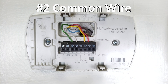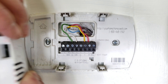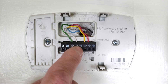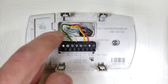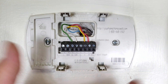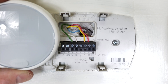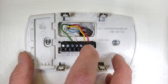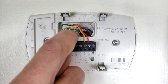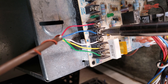The second thing to watch out for is whether you have a common wire attached to the existing thermostat. This unit had batteries so it didn't need the common wire. When installing a new thermostat such as a Nest, Ecobee, or Lyric, it's really important to have a common wire. If the blue wire was run to the thermostat but not connected, connect it at the indoor furnace or air handler to serve as the common wire to power the thermostat. Both R and C need to be connected. Connect the blue wire to the common terminal on the control board with the power off.